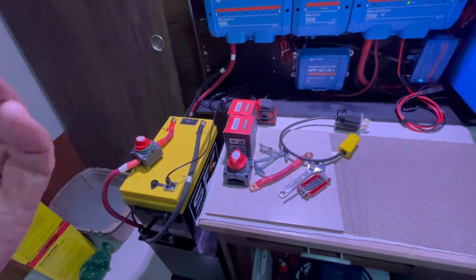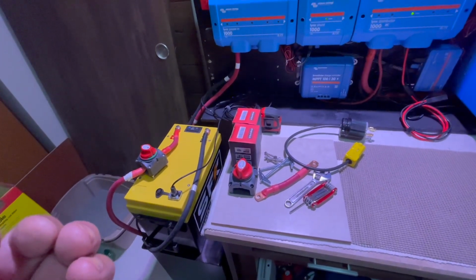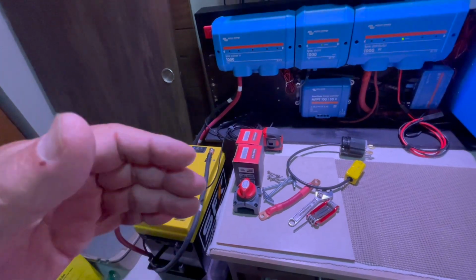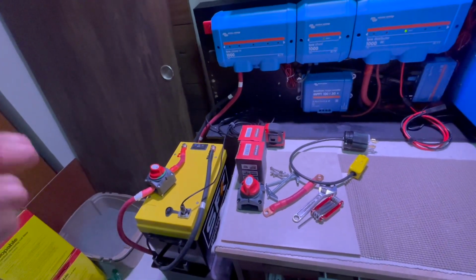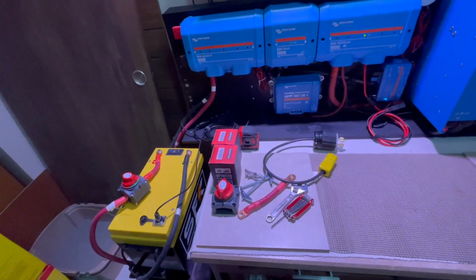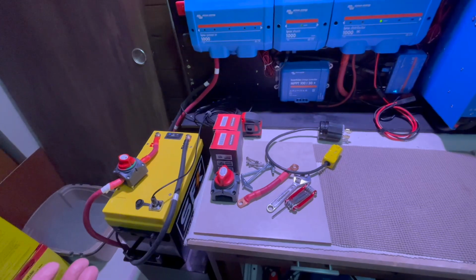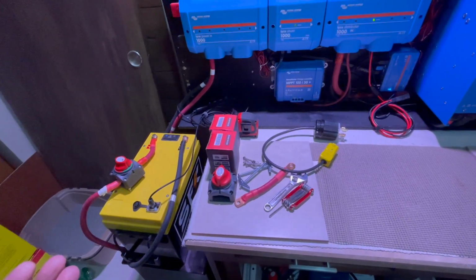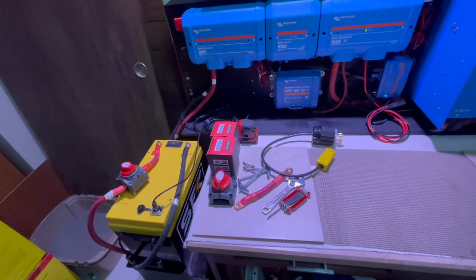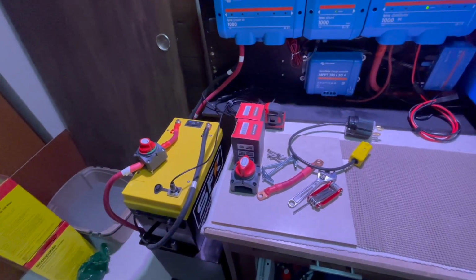I don't know. I think a lot of them are now trying to set up their BMS in such a way that you always have 20% headroom. They will claim that 14 volts or something of that sort is 100% charge, where in fact it really isn't. It's just 90%, maybe even 80, all depends. They're just hedging their warranty, I guess. The disadvantage of that, if you only have one battery, well, you got a 10% cut off when it's discharged, and you have 20% you lost on top. So basically you have 70%. But if you need 100, then you're forced to buy two batteries.